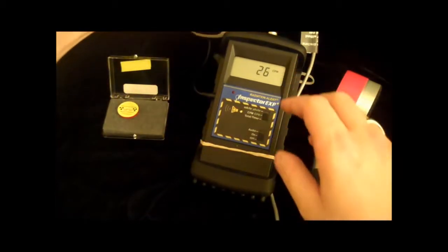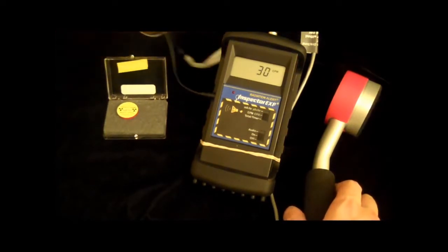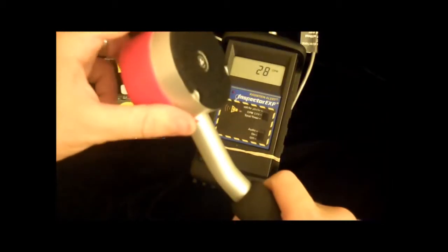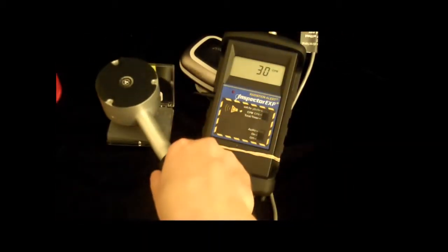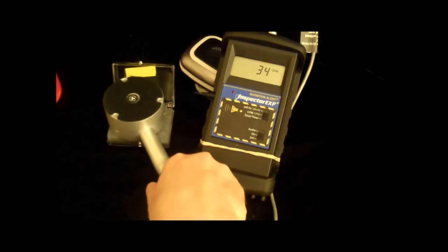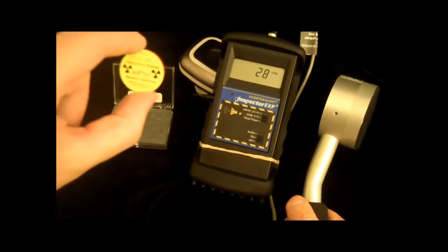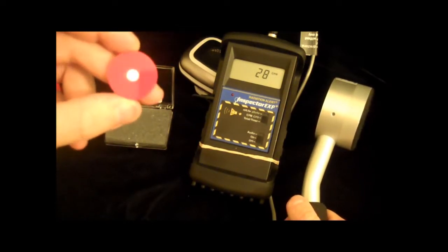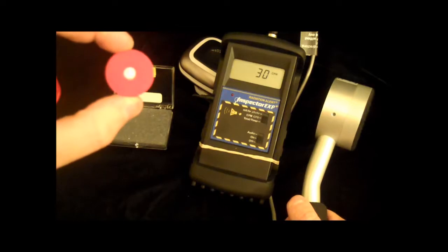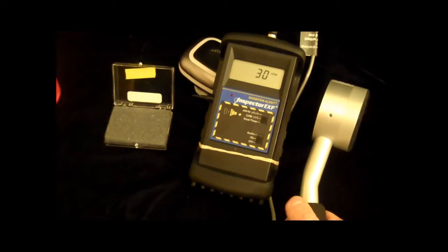Let's turn up the sound. This sounder right here may not actually sound good. I might want to switch to a different one afterwards. Here it is. It's a little speaker. It plugs into the Geiger counter. Now, pull the cap off my Geiger counter. Now, we're not going to touch this to this, but we're going to get really close. Nothing. Why? Because even the yellow on the back of this is enough to block it. You see that? That silver in there is what has the actual polonium 210. I keep saying americium, but it's the polonium 210.